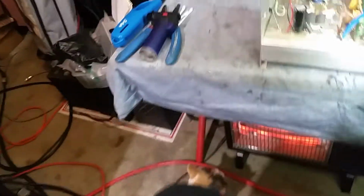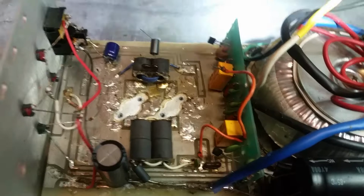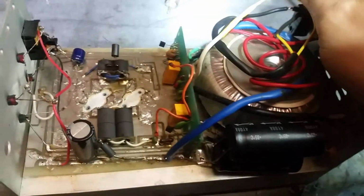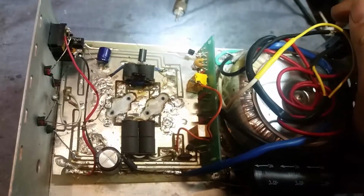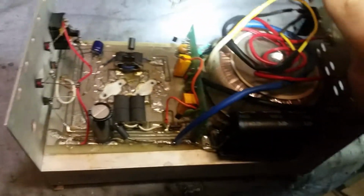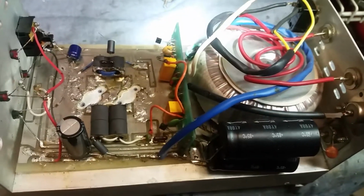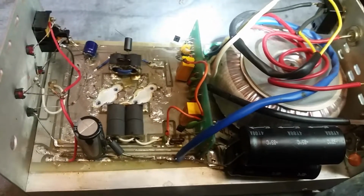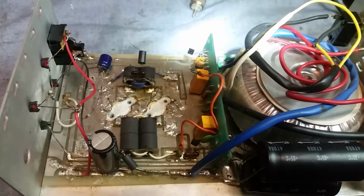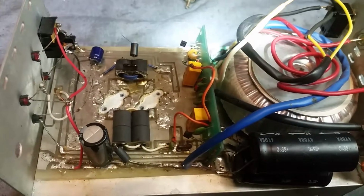It really is. You can tell some irons have been in this thing for the last couple of years. There's a little bit of trace missing in places. These transformers are not wrapped with Teflon wire. I just can't, in good faith, work on it till I unwrap the non-Teflon wire from these transformers and wrap them with Teflon, which should be in there.